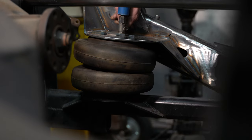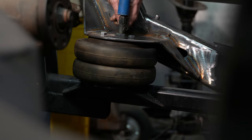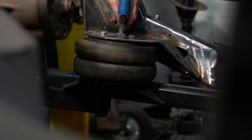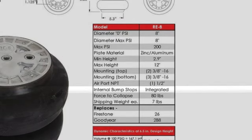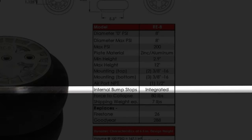If there's not enough space between your upper mount and your lower mount, your bag can bottom out and your truck won't be able to lay frame fully. Also, bags don't like to be bottomed out. Slam Specialties actually has a bump stop built into the bag, but I heard once that if your bag fails and Slam Specialties sees that the bump stop was used, they won't warranty your bag. So what's the bump stop for?